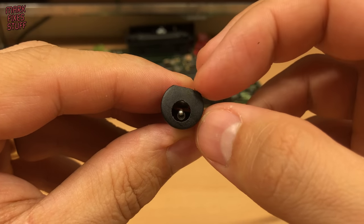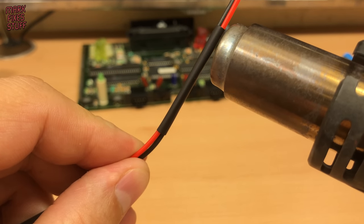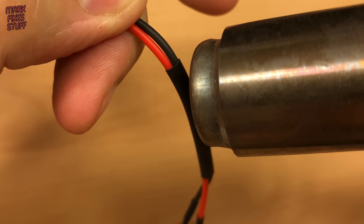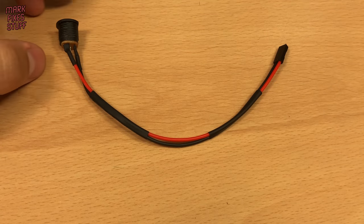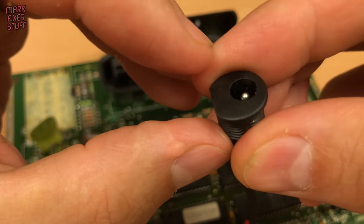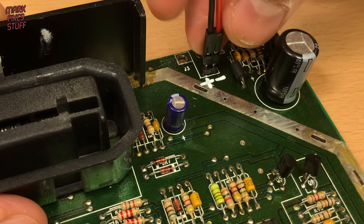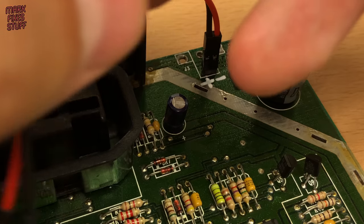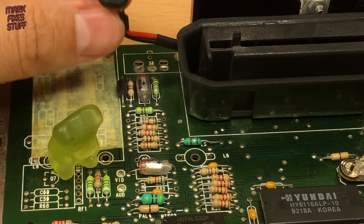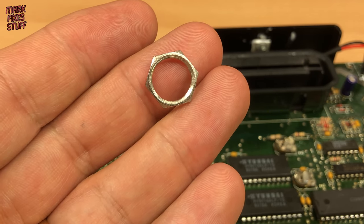If anyone finds these sockets for sale again anywhere, please let me know — I found some recently but they were slightly too large for the hole. The idea behind using these jumper headers is that the user could switch the polarity of the socket in case they didn't have a suitable supply to hand. The red wire is the centre pin and we'll make sure that's clear for future users. Because red is centre and I want to use a Sega Mega Drive PSU that's centre negative, I'm putting the header on with the red wire on the negative pin. This socket fixes in place with a simple nut, meaning no glue required.